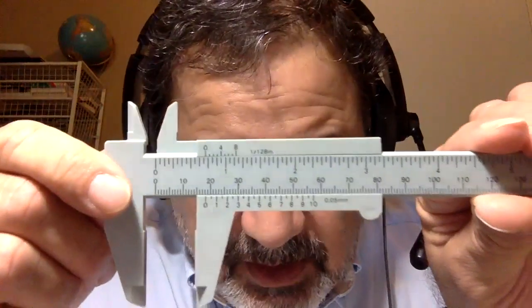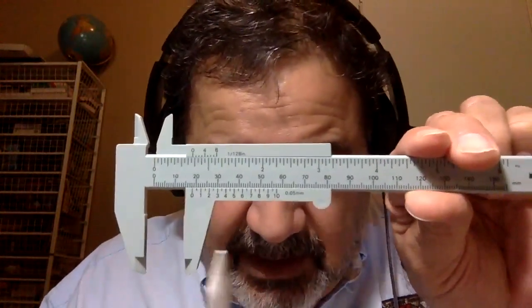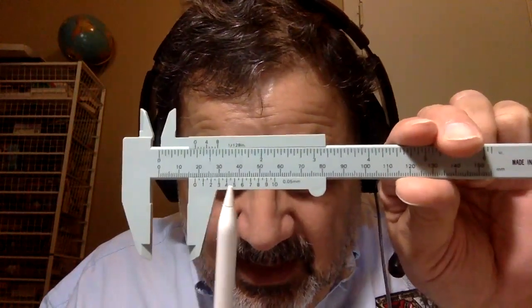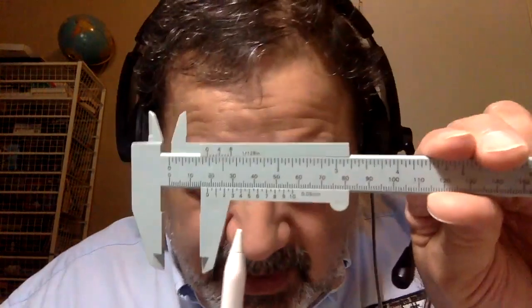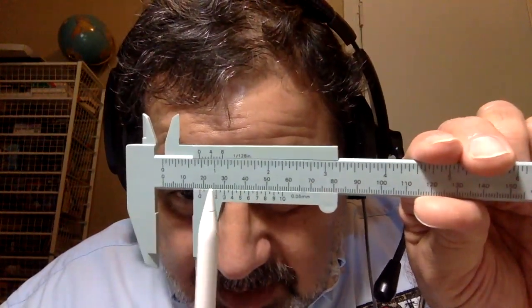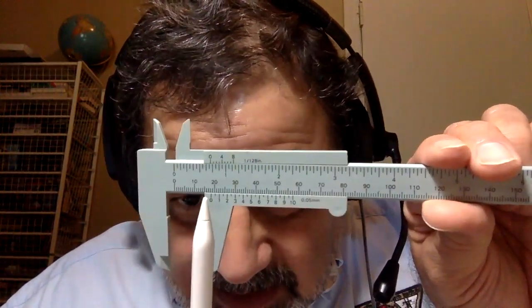It's like 18 millimeters. And the Vernier — you can see that it's at 18. You look where this thing lines up, and it looks like it lines up with the three. Look where these things match — the three pretty much matches up with 30. So that's 18.3 millimeters.